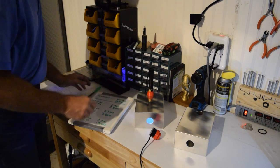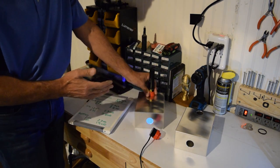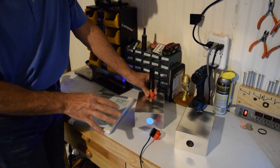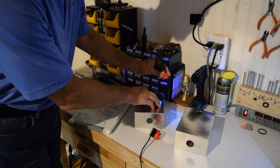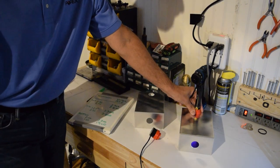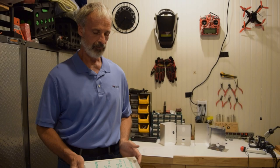So you can clearly see how much having a highly reflective, diffuse reflective material allows the light to bounce around multiple times and into the chamber, really getting rid of almost any shadowing that would go on in the unit. Whereas when you go back to the aluminum, after it bounces and hits around the aluminum, maybe once or twice, that energy is completely wasted.